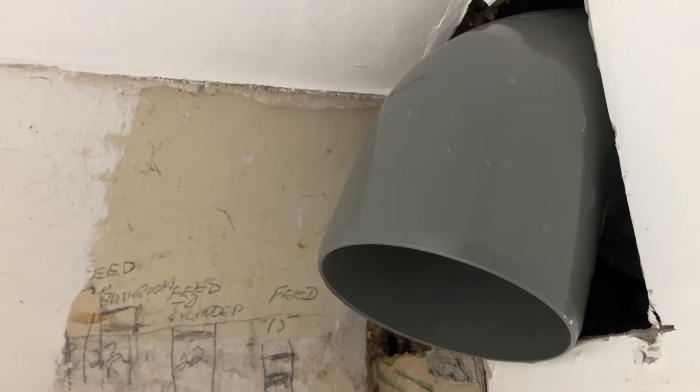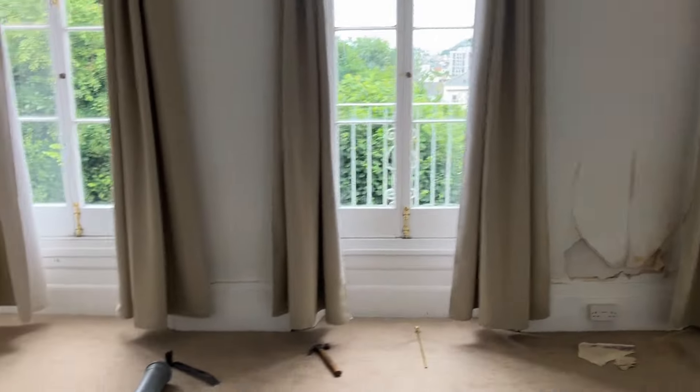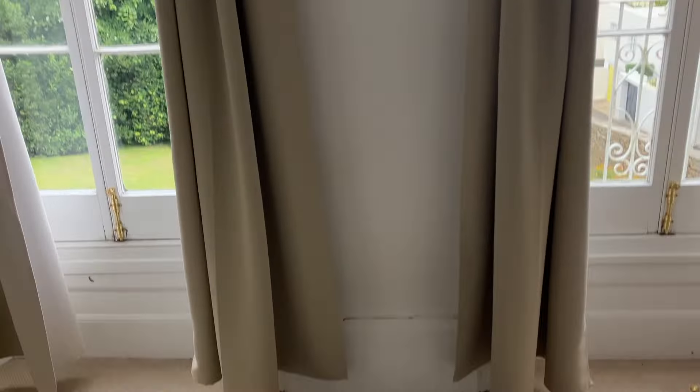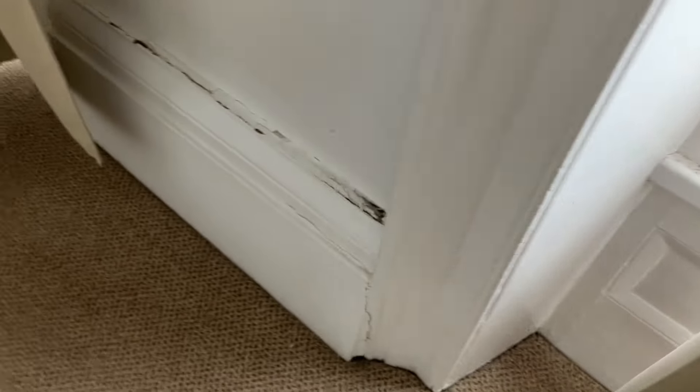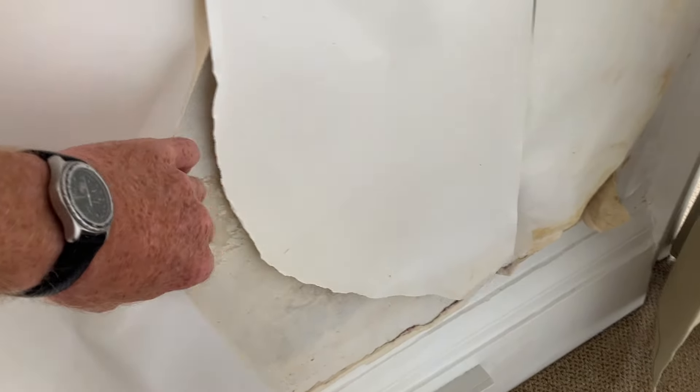Right, let's carry on with the hole. Hello again — we're back in the crescent building and I'm going to tackle these walls, just to put some thermal board on. I'll have to disconnect the electric supply but the meter's in there so I can shut everything down. These skirtings are a right mess so it'll be good to get them sorted out. I'm going to strip this off — it's wallpaper — so I've got something decent to fix to. Yeah, it doesn't like it — that is soaking. I might have to look into it a bit more — I think I'm going to get a damp meter on that and see what's happening.